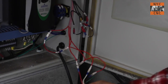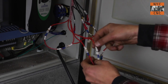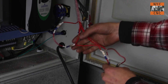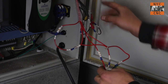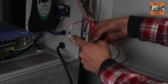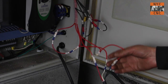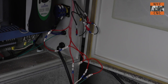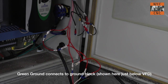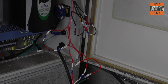To review: the four lines from the new black cable harness — 102 is red, 103 is black, 104 is white. Tormach does a great job with labeling and I really commend them on that. 104 and 105 get jumped together using the included jumper wire labeled 104-105. Same thing with 204-205, and then 202 and 203. I shot an email to Tormach about the ground clamp shown on the door connecting to the green wire — I don't have that part, so I need to figure out what to do.